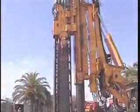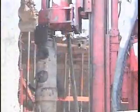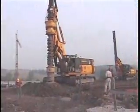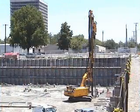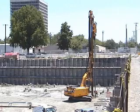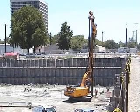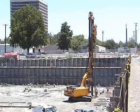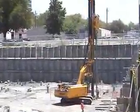ABI is a manufacturer from Germany which has produced over 1400 multi-purpose rigs that have many different attachments for many different jobs. This video looks at the vibropile. A vibropile is generated by vibrating a probe into soft ground, thereby displacing all the material in its path. The vibropile can be used to produce piles, vertical tie-downs, and stone columns.